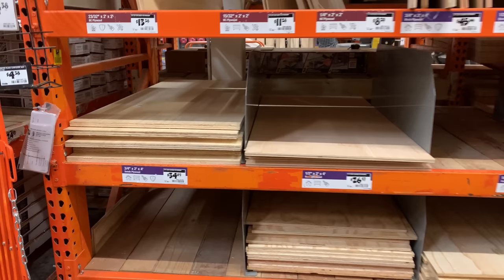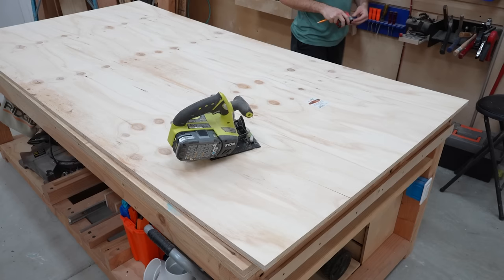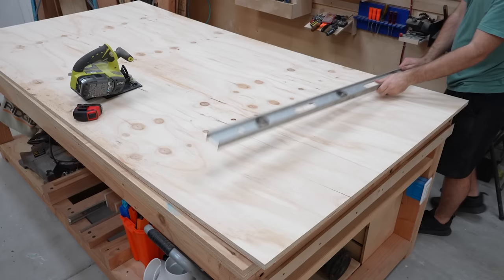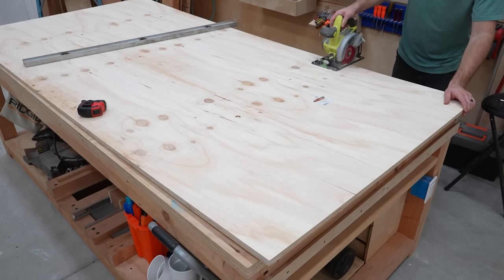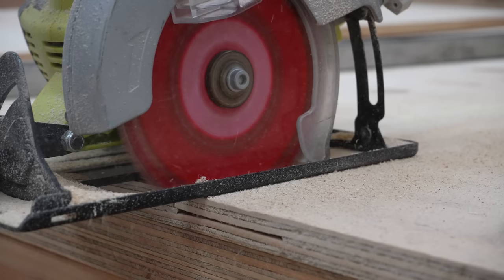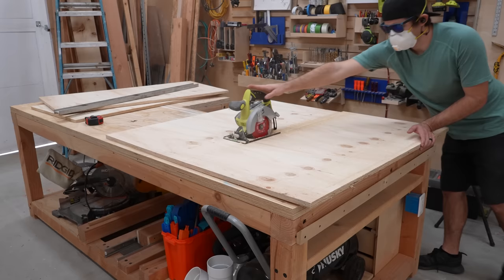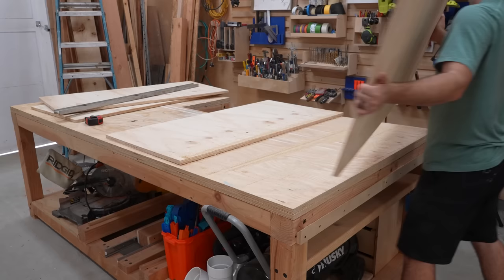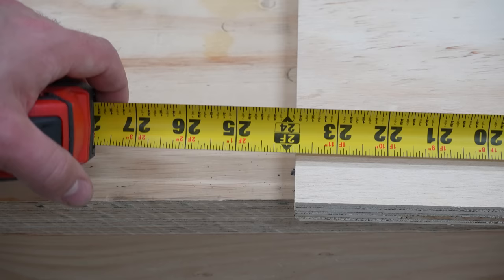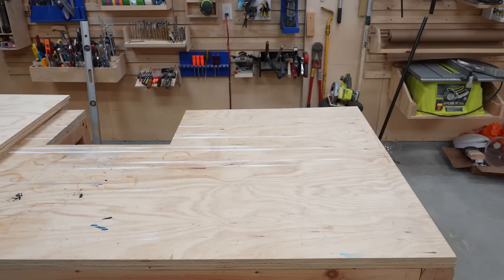All the stores around me sell plywood in two-foot by four-foot pieces, which is the exact size you need for these workbenches. Each cart needs two pieces that are two feet by four feet. One dimension is already four feet, so measure two feet along the eight-foot edges and connect the marks with a solid line. Make your cut and repeat. If you're building multiple carts, go ahead and cut out all your pieces. Keep in mind the final piece of plywood will likely be slightly shorter — about three blade thicknesses shorter. Mark that one as the bottom piece because we'll use it in a specific spot.